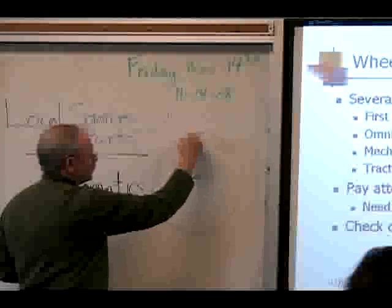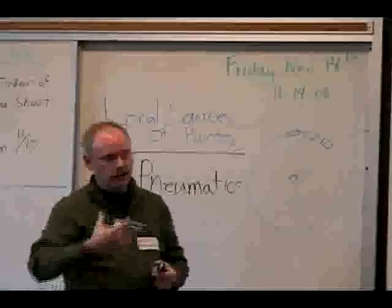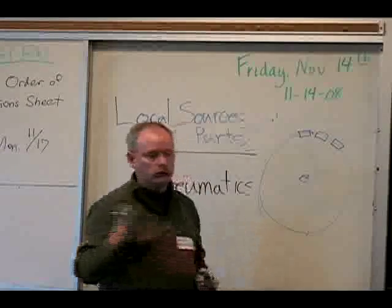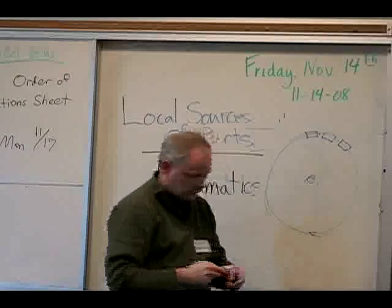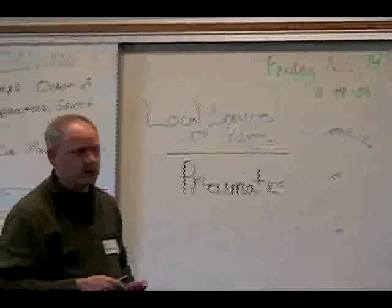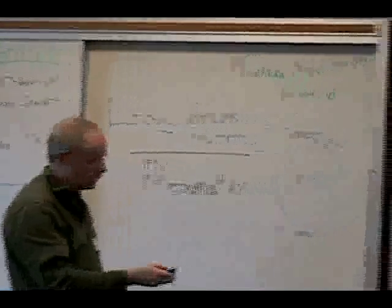is like a normal wheel, except it has a bunch of rollers all around it. So as you're turning, it eliminates the friction you're turning into, because you're not dragging a wheel sideways like you do with a car. Pluses and minuses: that also means it's maybe a little easier for somebody to push into you and turn your whole robot, so the friction either helps you or hurts you in certain cases.